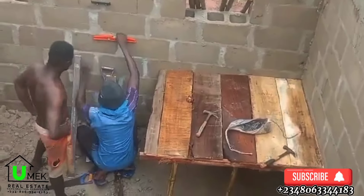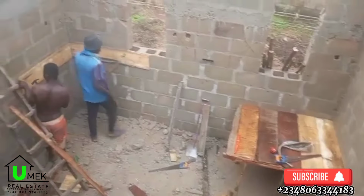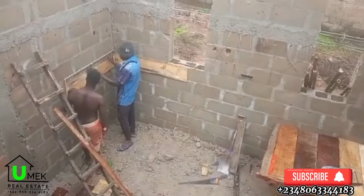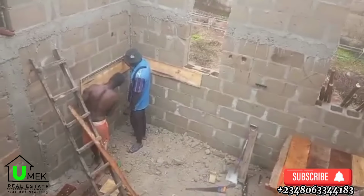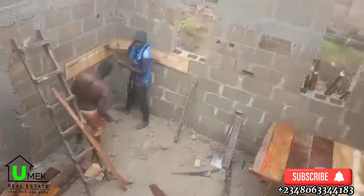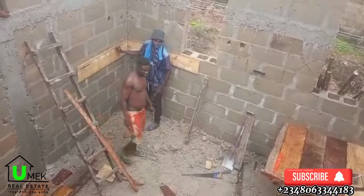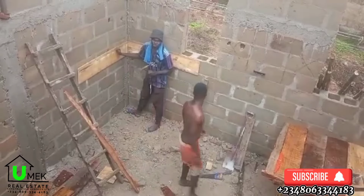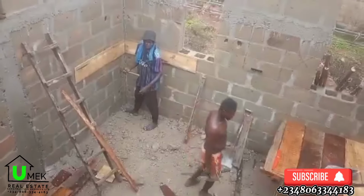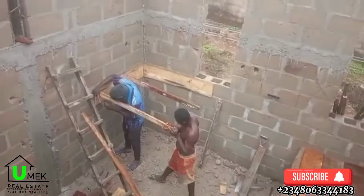Here, the engineer and the carpenters are marking this out one step after another before we determine where the half landing is going to be, and finally the height at which the final landing, which will land on top of the decking, is going to be. So this is what is going on here, carefully marking out the stairs to ensure we have equal risers and equal going, which helps when you're climbing the stairs later on at the commissioning of the building.